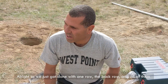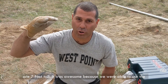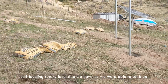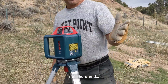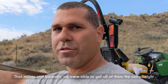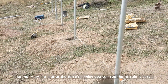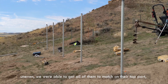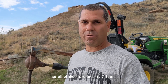We just got done with the back row, and all of the posts are seven feet tall. It was awesome because we were able to use the self-leveling rotary level. We set it up and were able to get all of them to the same height. No matter the terrain — and you can see the terrain is very, very uneven — we were able to get all of them to match on their top part, so all of them are level to seven feet.